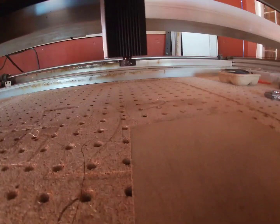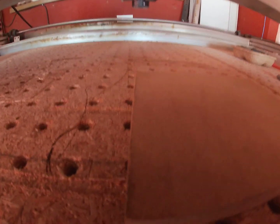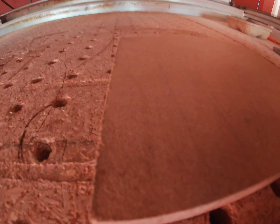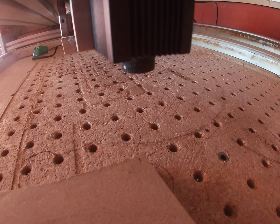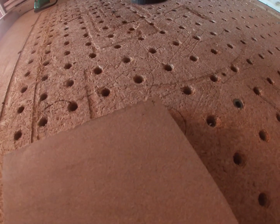It's got a focus at the bottom. The focus is very important when you're doing laser work - where the laser converges needs to be set as fine as possible, because if you want sharp laser work and crisp lines, your focus is of utmost importance. Even in a CO2 laser, your focus has got to be set right, otherwise the quality of the work that comes out is not what you want.